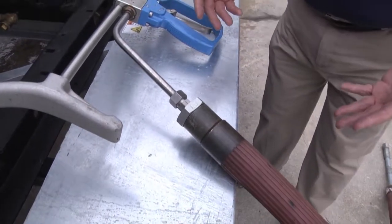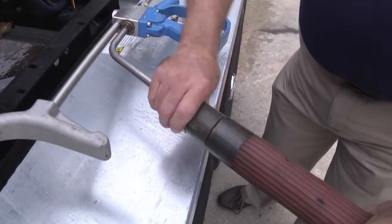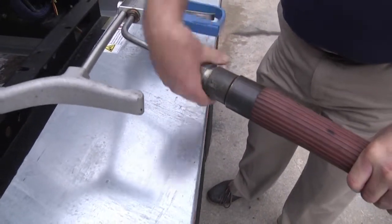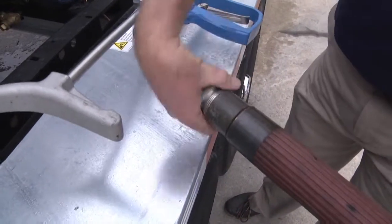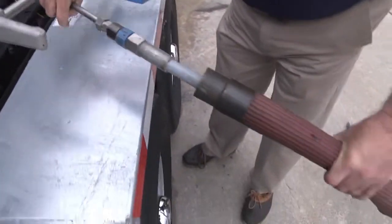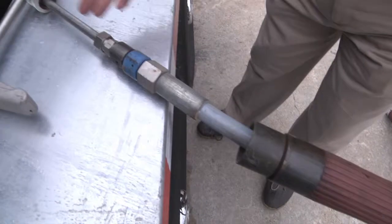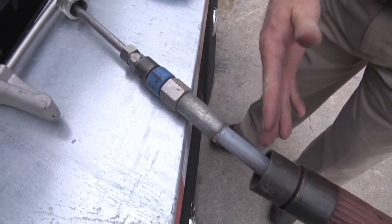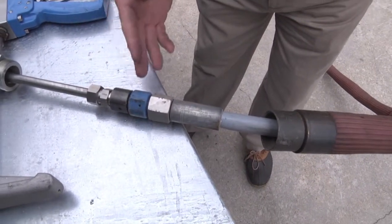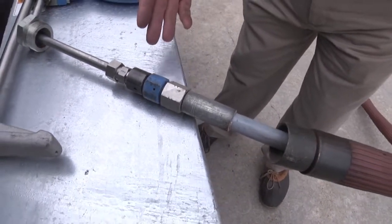It's relatively simple to do. This is just supposed to be a hand-tight thread on the cap. It carries no pressure. It just holds the shroud in place. So unthread this, and pull the safety shroud down to check the condition of the metal and the whip hose underneath the safety shroud. These should be stored with the shroud pulled down so that they can dry and not rust. Each person that takes a shotgun should examine this prior to doing water blasting.